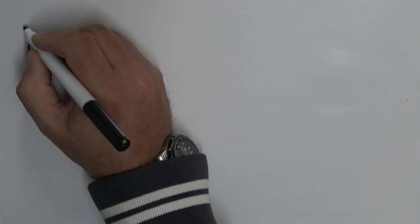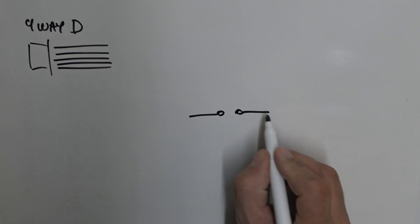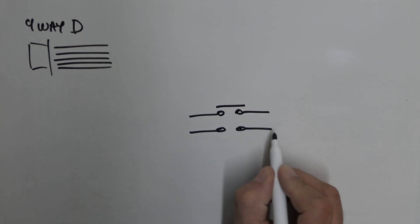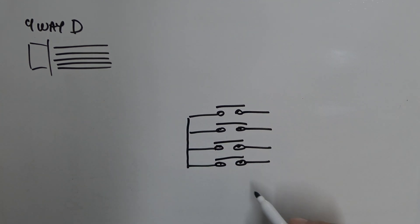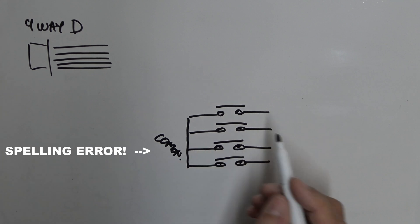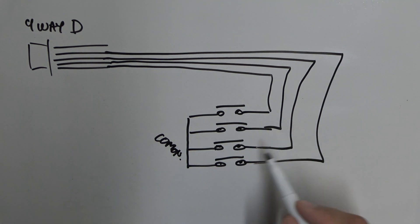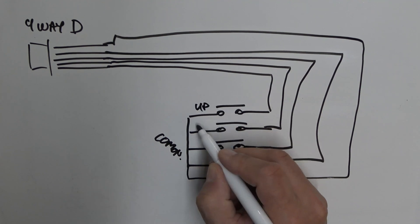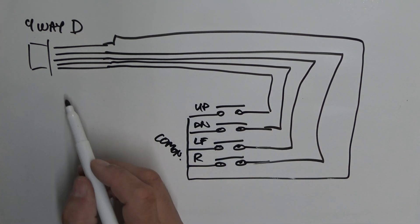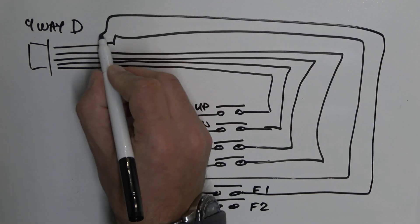Standard digital joysticks are relatively simple inside. They consist of a nine-way D connector, a bunch of push buttons, and a common signal — or ground. Each one of those joystick buttons makes a contact. Those joystick contacts are up, down, left, and right, and then you've probably got one, maybe two possible fire buttons, which are connected to the same common and connect to the nine-way D-type connector.